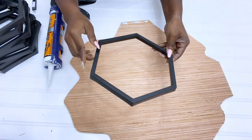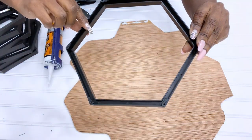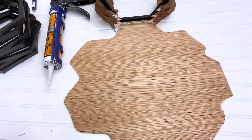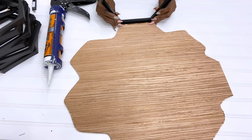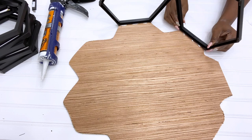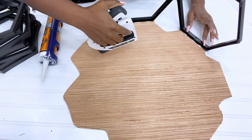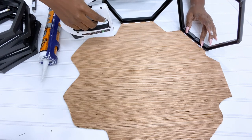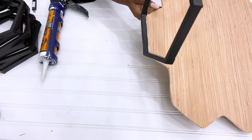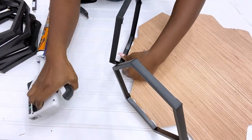The side of the frame will be facing outside and this side will be facing inside. To keep these in place as I work, I was stapling it down directly with the staple gun and it made it crack. So what I did was to turn it over and staple it from the bottom — that way it met the wood before touching the plastic without breaking it.